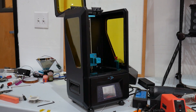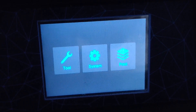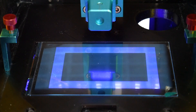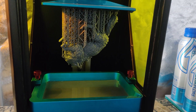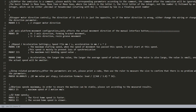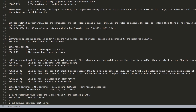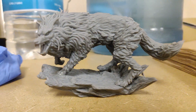You should now have a machine that is good to start testing. Always do dry testing before doing anything with actual resin to make sure there are no bugs or mistakes in any of the prior steps. The firmware preloaded on the Cheaterboard looks nearly identical to what you'd find on the Mars or the Photon, so you don't have to worry about changing any parameters — it's good to go. However, there is a handy G-code file linked in the description that allows you to change most aspects of the machine and how it functions. I'm in the early stages of stress testing this mod, but so far I'm incredibly happy with how it goes. And that is how I overclocked my Anycubic Photon and turned it into a blazing fast one-second-per-layer, highly precise machine.